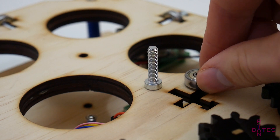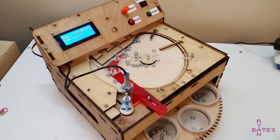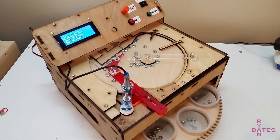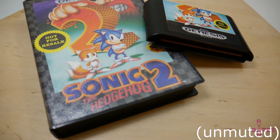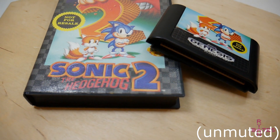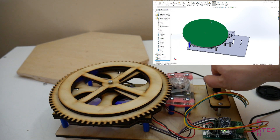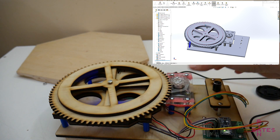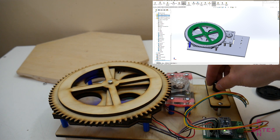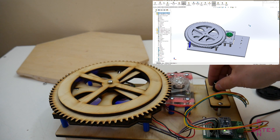This is my first version, sticking with what I know and already designed. This is the indexing platter from my small parts counting machine. I have plenty of these NEMA 17 motors so I decided to use them, and that's where the problem is. When the audio is unmuted you can hear the issue: that NEMA 17 motor is loud when driven from a basic L293 driver. Sweeping through the RPM range also shows a few speeds that tickle the resonance frequency inherent to this design. I do have a damper installed in the motor along with bolts loosened so the vibration isn't transferred as much.